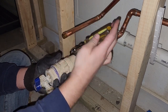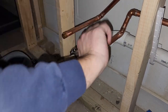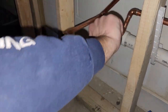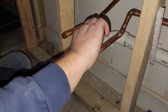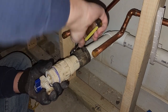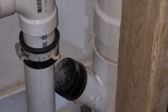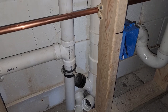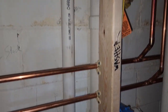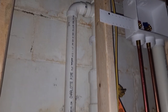In a second, I'm going to show you one last part — we had to disconnect this drain just to stop it from draining. Since this sink drains out underneath the most recent clean-out you saw, we did have to disconnect it so we can fill the system through this. Right here is what I'm talking about: there's a rubber cap on each end and there will be a PVC 45-degree fitting going in there. That's the clean-out right there, and the sink drains out below it, so no water would be holding.